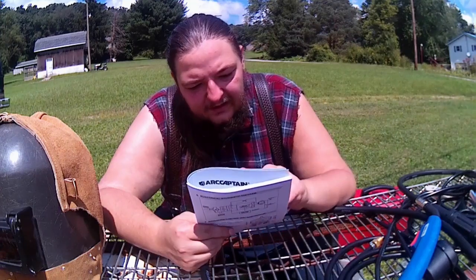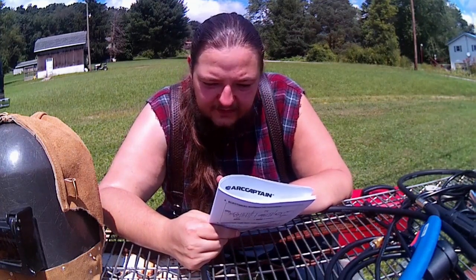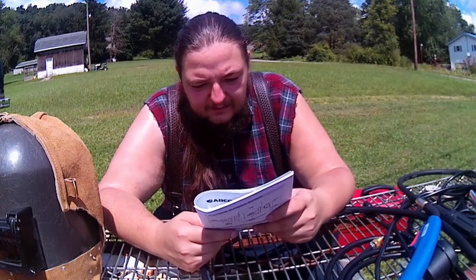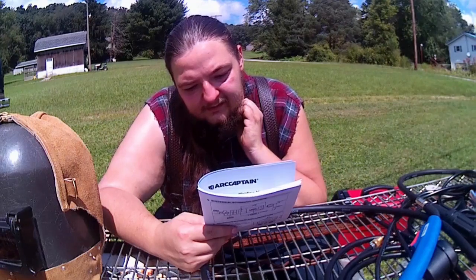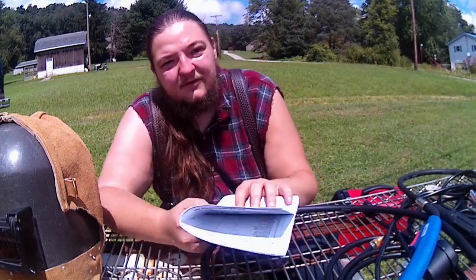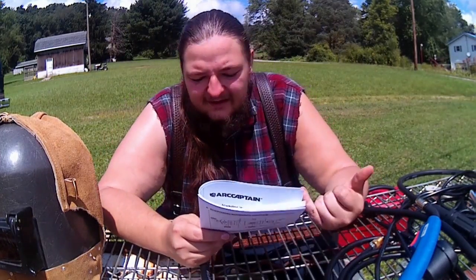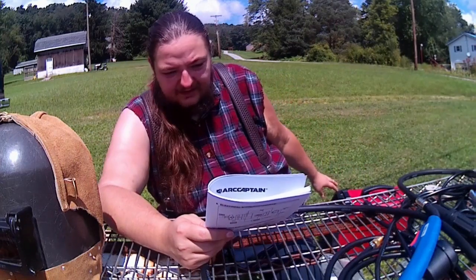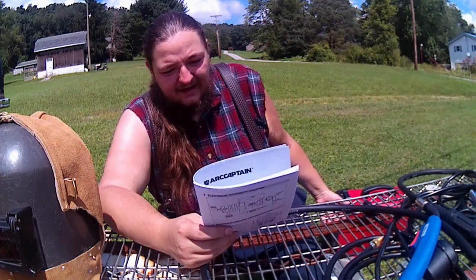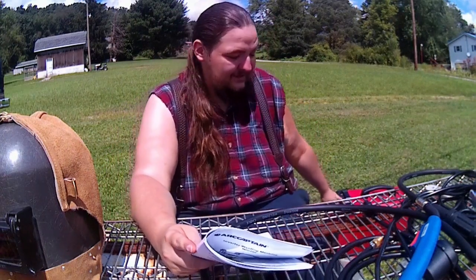For MMA, which is regular stick welding, SMAW here in America, on the 220, 180 amps is 20% duty. Oh no, yeah, 180 amps is the max. 20 is the lowest. Sorry, I was reading that chart backwards a little bit. Anyway, stick is 180 max, and 20 is the lowest. And it has a 60% duty cycle on that, which is pretty good for how much this machine costs.